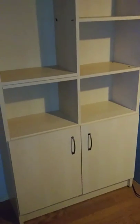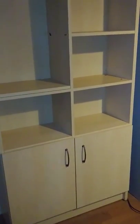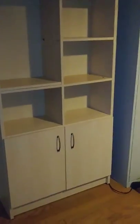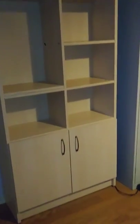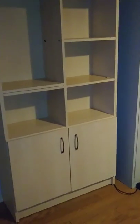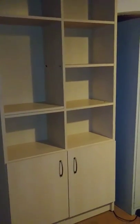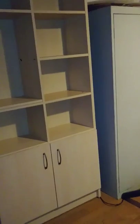That's how I fixed up this nice cabinet shelf that I got for free. It's an IKEA design, and from what I heard they don't build them very well. This thing is going to last a little longer now. If you find one or have one that's leaning to the side and it's weak, you want to add some wood bracing in the back to keep that paneling secure. The main thing that made the difference was that pine strip down the center, because it locked that board in place all the way down — otherwise it was just sliding down and not holding anything. When it's pushed all the way up into the top plate, it stiffens it up.